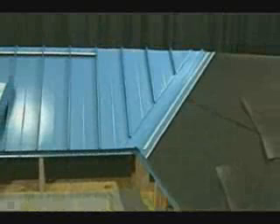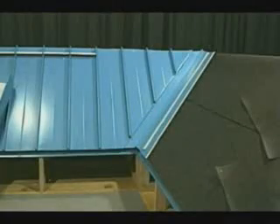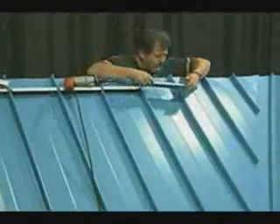After one side of the roof is complete, we will begin finishing our trims. As we stressed before, the roof is not totally weather tight until all trims are complete. We will do this by either using our ridge as our guide or measuring down from the ridge to give us the proper location for placement of the metal Z closures.